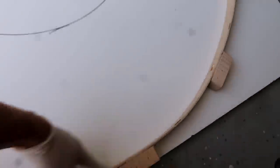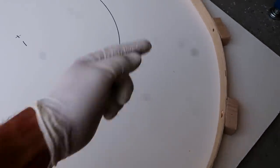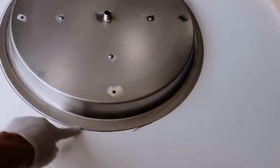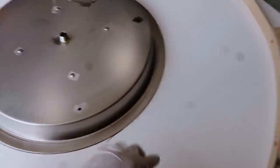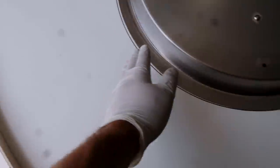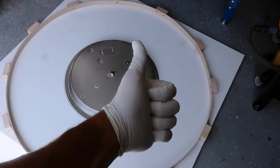I'm going to line the edges all the way around to make sure everything is sealed and gives a round-over edge, then I'll use a caulking tool to shape that edge. I'll flip this upside down, lay it right in there aligned to where I traced it, and put a bead of silicone around it. The reason: the backside of this is actually going to be the top side when we flip it over, giving us the perfect finished surface including this little tapered edge. Let's put some sweat in.